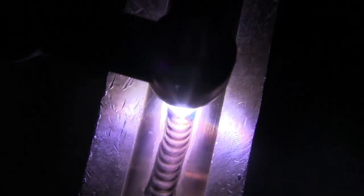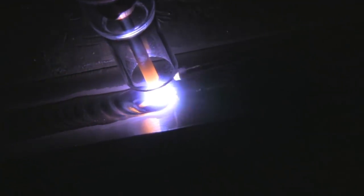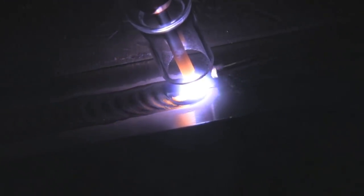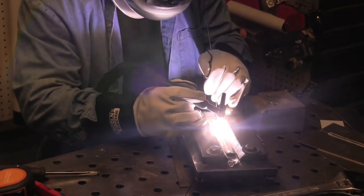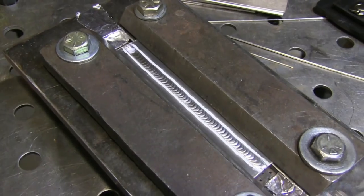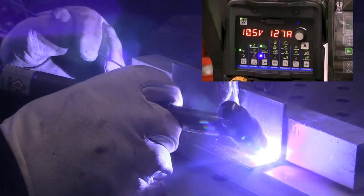This is a 063 / 1.6 millimeter thick aluminum butt joint. I'm using a Pyrex cup here because it really helps see everything — not only while filming, it kind of lights the way for an old guy like me to see where he's going. This is a number five; I also use a number eight like this. I sell the number eights on the website and they work good for a joint like this too.